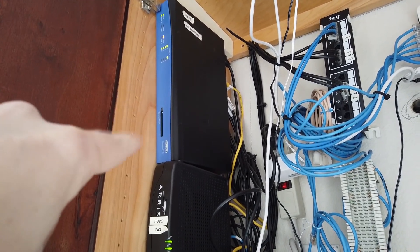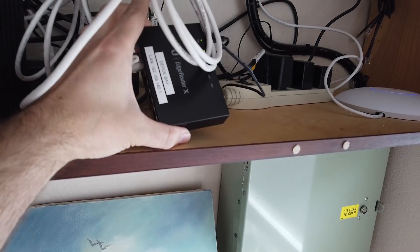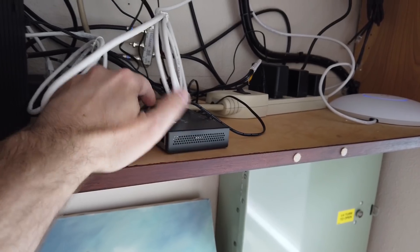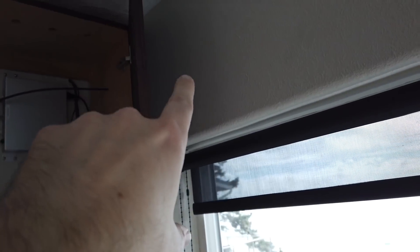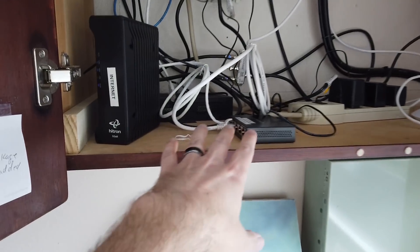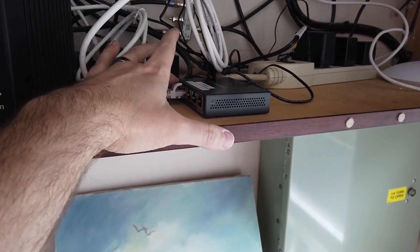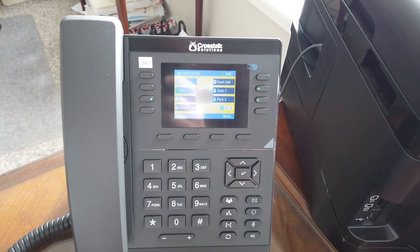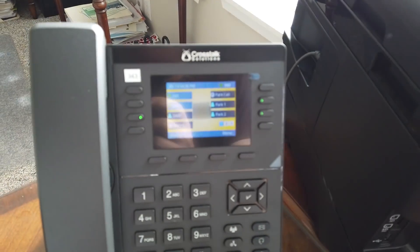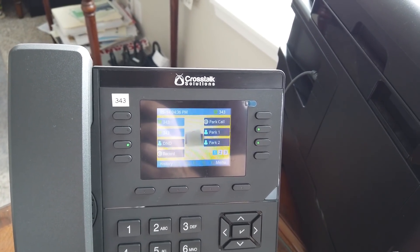About halfway done. I put the US8 150-watt on the wall right there but I did not have the mounting kit for the EdgeRouter X — must have fallen out at home — so I'll find that and come back. I still have to mount the UAP AC Pro, which I'll likely mount on the wall right out here. Good news: this was actually in bridge mode, so I was able to put their network into the EdgeRouter X and it pulled a WAN IP address directly to the WAN interface — that's perfect for VoIP. I've already hooked up the first IP phone and it's working great, two-way audio both inbound and outbound.